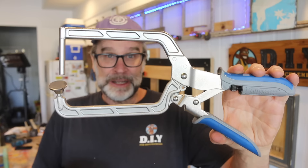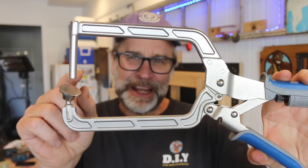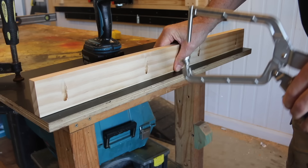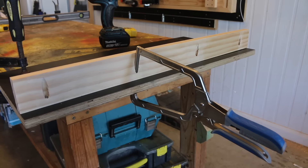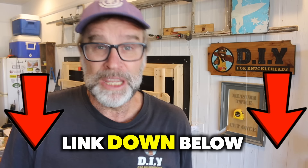The second one I highly recommend is this funny looking thing here called a right angle clamp, which has a pad and this intriguing looking pin. The reason behind the steel pin is so that it fits snugly into a pocket hole, to clamp the pieces together as you drive your screw into the adjacent hole. It's kind of like having a second pair of hands to hold materials at a perfect 90 degree angle. These clamps are going to be your next best friend, and I'll link to the ones that I use down below if you're interested in taking a look.